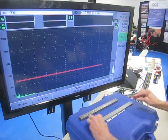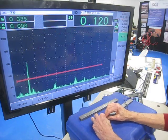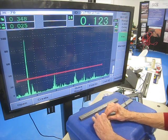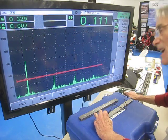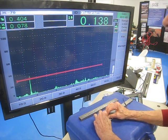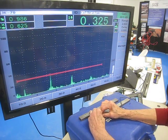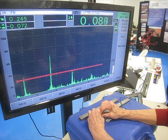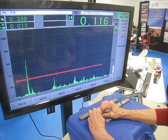So I'm going to start by looking at the 90 deep tip, and I'm walking over the top of that flaw with my 70. I wouldn't really call this tip diffraction, I'm just walking over the top of the flaw. And I'm going to take 6 dB out so I can see the top of the flaw, and where I maximize going over the top is right about at about 120. It actually is 90 deep, but with this cal I usually end up seeing it about 120.